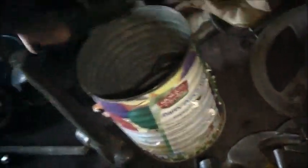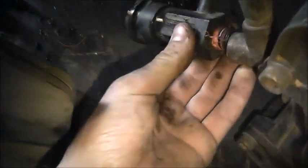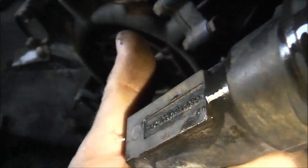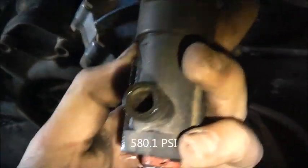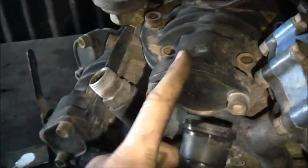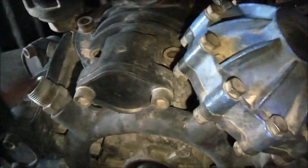There's a pressure release here, like a pop valve for an air compressor tank. That goes on there and limits the output pressure. This is calibrated to 40 bar. So if we get any more than 40 bar, this pops and water shoots out of here. Otherwise, I have seen these head bolts get broken from the pressure — they're pretty intense. So you've got to make sure these are in good working order.